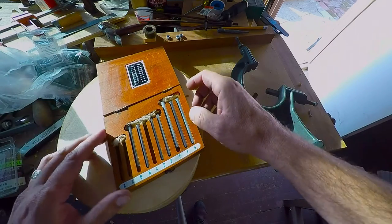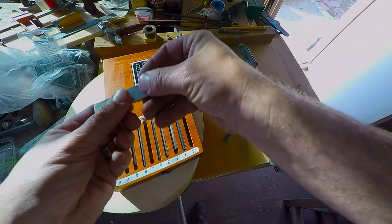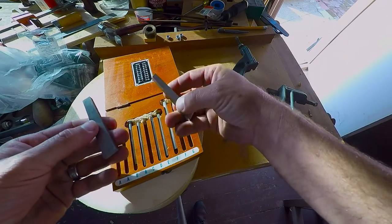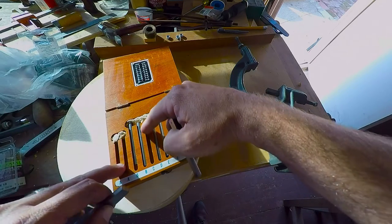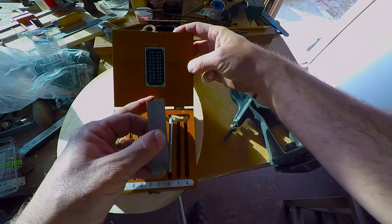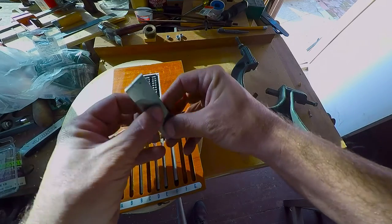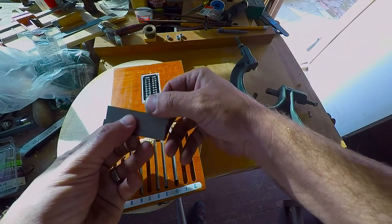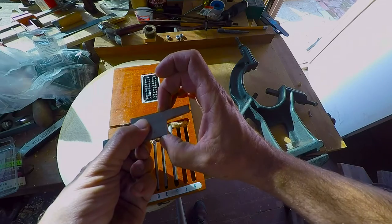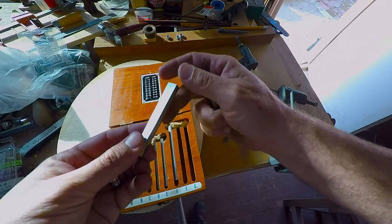These are a set of tapered parallels — kind of like tapered parallel parallels. You pick them up and make different combinations. They're angled, so you put them together and there's a chart for whatever sizes you use together, covering a range. They're rounded so you can put them inside a bore or in a square slot, wedge them in, and then measure the outside with a micrometer. I think these were like five dollars — a pretty screaming deal.